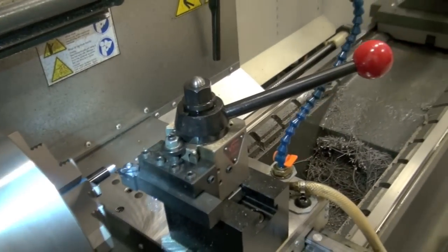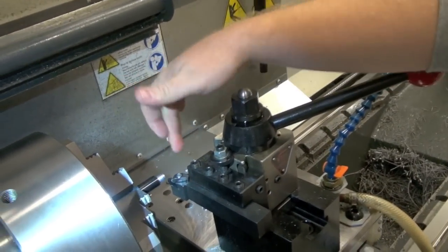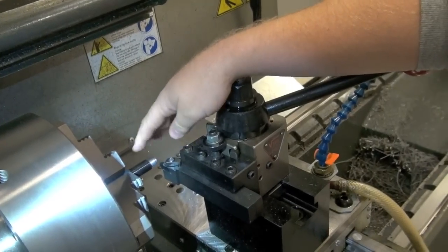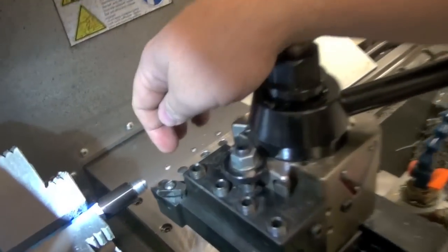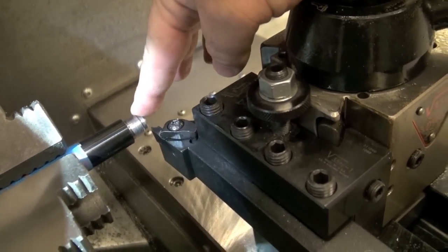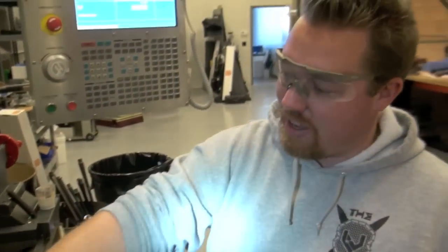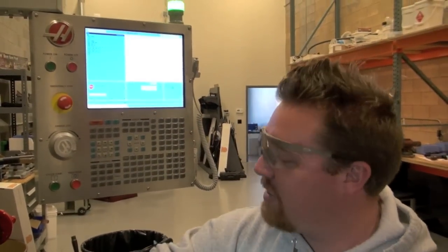So, what we've done is we've told the machine where the front of the thread tenon is, for this threading tool. And right off the face here, we've got our length cut, we've got our O-ring cut and our 45s. So we've already got the program in here for the threads. It's 0.48 inches long, but this cutter is 62 thousandths wide, so we've taken that off.